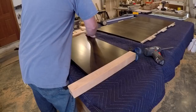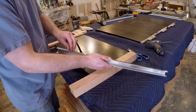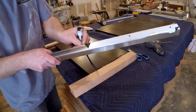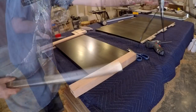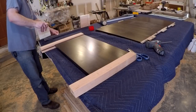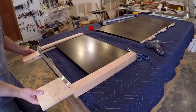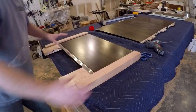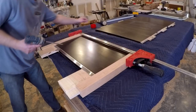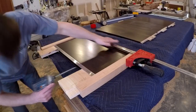The jig helped me hold the panel and the stainless steel in place while I screwed the two together. I'm told this protective coating is some sort of PVC, but it seemed more like vinyl and was a huge pain to get off. The scrap pieces of wood I'm jamming into the stainless steel channel have tenons on the ends, and those tenons slide into the dado to help keep it all centered while I screw it together. To avoid pre-drilling all these holes, I just used self-tapping screws into the wood — worked out great and saved a ton of time.